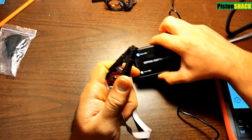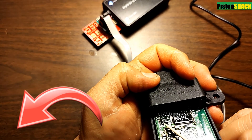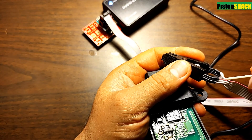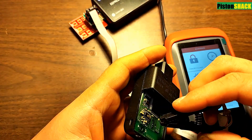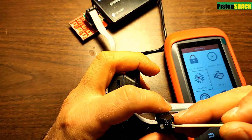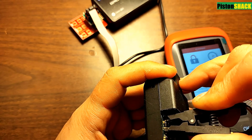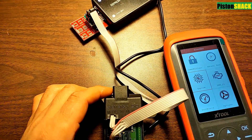I'm using an EEPROM adapter with an EEPROM cable and clamp. I got those separately and I've put all the information about my tools down in the description. This is our EEPROM chip — now we're identifying the numbers and series of that chip and locating the first leg. The first leg should be connected to the first pin on the clamp, represented by the red wire. You'll see a small dimple on the chip near the first leg. Once we clean the sealant, we should have a good connection and grip to access our pin data. The plastic parts of the clamp go in between those pin legs and grip there, giving metal-on-metal contact with the chip legs. Open the clamp, push it in, let it close, and make sure the clamp won't get loose.